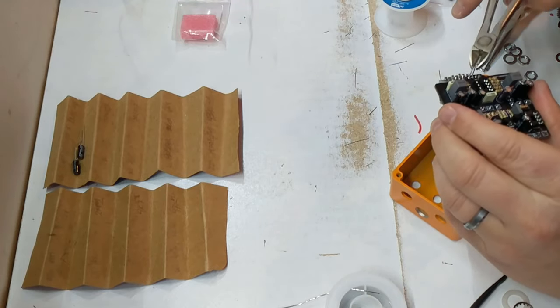Just one last check we can do: I'm not going to run this through the full test on the guitar because it might take a little bit longer than I want. Essentially we just want to make sure we get that LED coming on and off — that's usually the first check I do to ensure that the true bypass stuff with the LED seems to be working. Normally I'll set those to 50% for when I connect this to the guitar the first time. Worst thing you can do is have your level all the way down, plug it into your guitar, and then panic — only to realize your level is down. So yeah, that's pretty much it for building out one of these. I'm going to do a demo on this maybe in an upcoming video. That's it for the Delegate Compressor DIY PCB effects build.